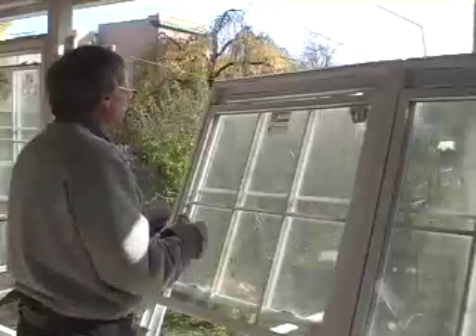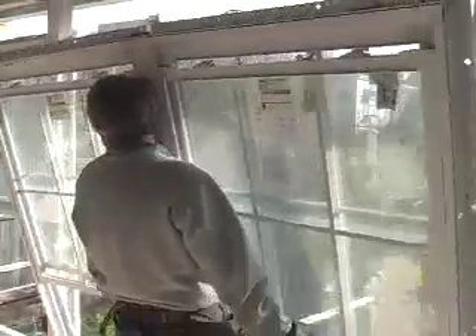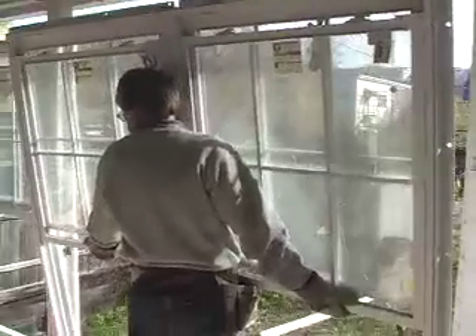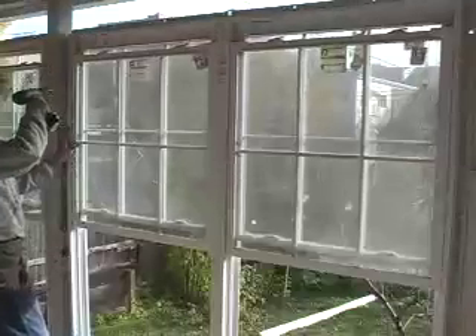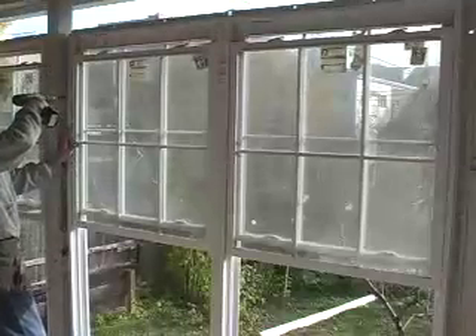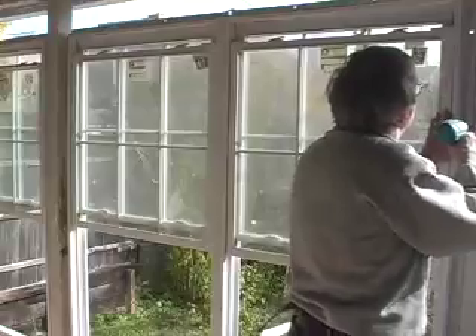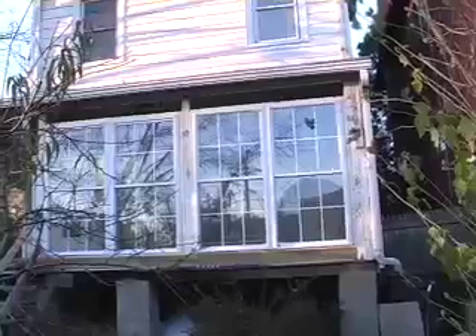The neighbor's gone, I've got to do this on my own. It takes a bit of time — lift it into place. I've got the trim ready to go, and that glass is double glazed. I work with what I've got, so I'd love it to go right to the top of the roof but it didn't — that was cheap, and fitting custom glass would cost a lot of money. I'll show you how I dealt with the other space later on. We screw the glass in place and then put the header in to hold the top of the glass — that also gets drywall screwed in.